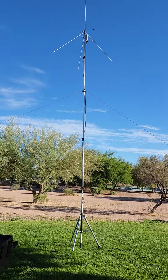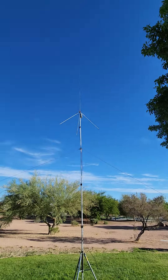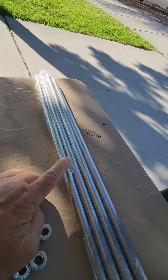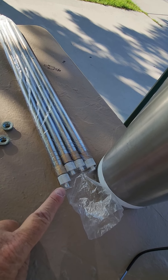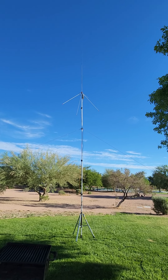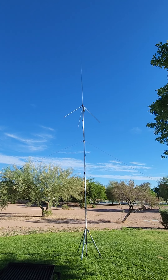You can see we've got pretty short radials — only four feet long. One thing I can do to enhance this is use more of these telescopic whips as extended radials. Since these threads are 3/8-24, which is exactly what the donut ring for those four-foot radials takes, it's the same standard 3/8-24 thread. I could extend each radial out as far as 18 and a half feet, which would give me even better performance, a lower launch angle, and a little more efficiency.